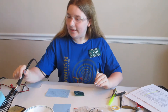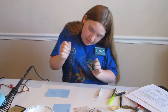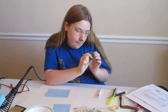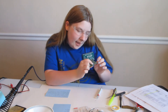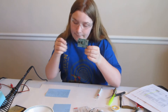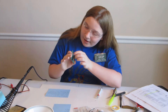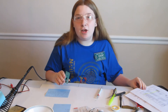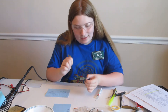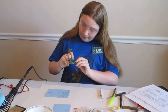Hey, this is Caitlin KS3P, and on my Rockmite 20 I just finished installing the U1. It's a little chip with eight leads and it's surface mount technology. To install it you need a very fine tipped soldering iron and use very little solder, because it's very easy to bridge. The instructions say you should install it first because it's very tiny and easy to lose among the other parts.